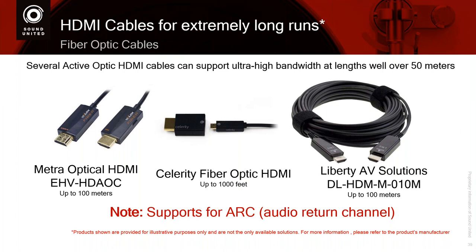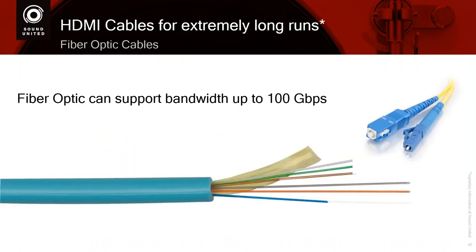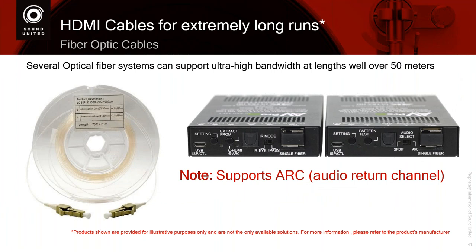Please talk to the cable manufacturers. The ones we do know you can utilize are — if you pull fiber — they call it fiber optic cable. It's this dedicated cable through the wall. This is already rated to support 100 gigabits per second — double what HDMI 2.1 specifies. There are actually baluns available for these cables. You basically pull this in the wall, use these baluns — you may have to upgrade the baluns in the future — but that cable in the wall is good. So you never have to worry about it. Fiber is always the best way to go. Go to copper — hopefully it'll work. If not, go to active copper. If not, go to a fiber optic cable. And after that, go to raw fiber. If you pull two pieces of this thin wire in the wall, there is no way you're going to have to worry about not being prepared for 2.1.